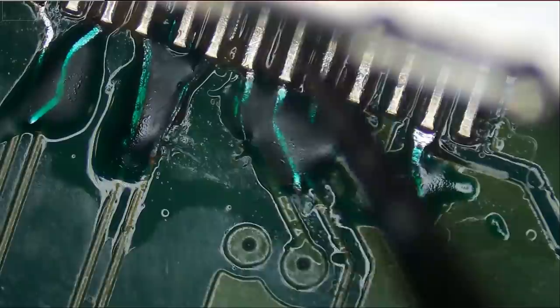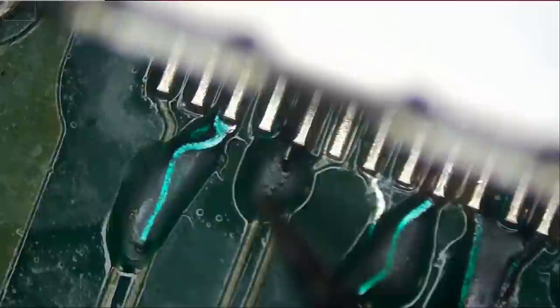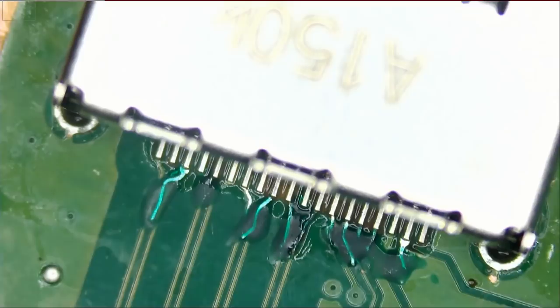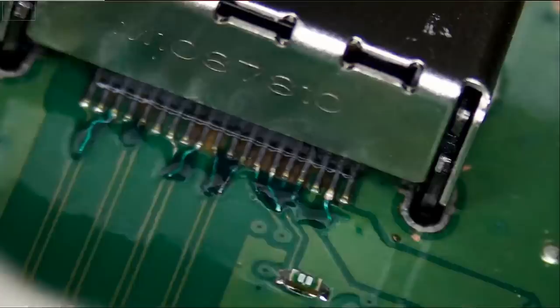Okay, I can tell the pad under it is moving along with the pin. So that's good. If that pin is not making a connection with anything, it will move freely to the left and right. And we should be able to immediately tell that the pin is not making a connection. I'm zoomed in a lot, so we have a short focus point. All right, we are solid. Just take a look at this piece of art. And look at that. Beautiful, beautiful. Let's flip the board, solder the back.